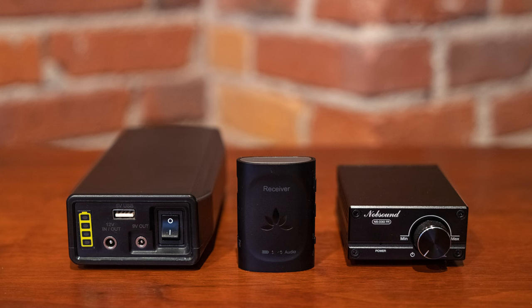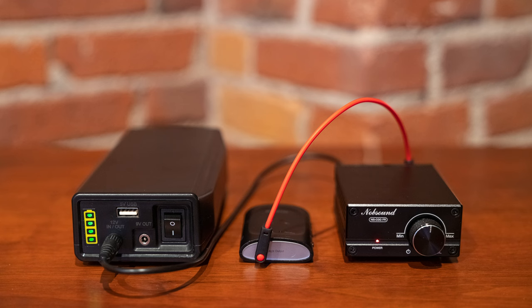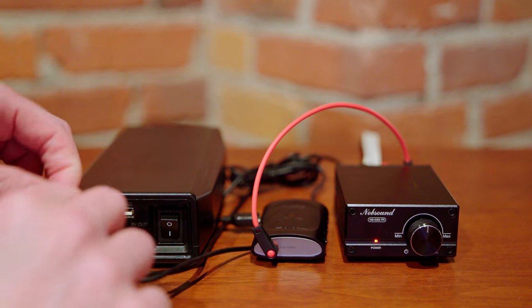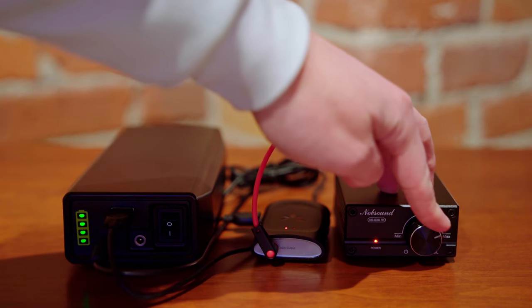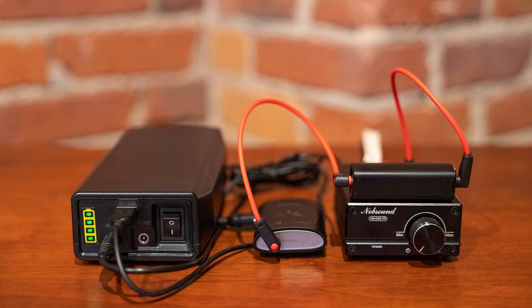Here we have the 12-volt power supply, the wireless receiver, and the amplifier. First, we connect the wireless receiver to the amplifier — there's your audio. We then connect the 12-volt power supply to the amplifier, and connect the speaker to the amplifier using cables with banana plugs. The wireless units can be charged and powered via USB-C, so I plug it in — and that's when I find my first problem. There's some sort of terrible squealing sound and hiss. My guess is this is a ground loop or interference introduced by the two units being connected to the same power source. As a workaround, I added an audio ground loop isolator, which effectively breaks the electrical connection I suspect is causing the noise.